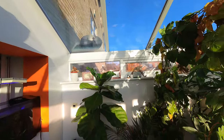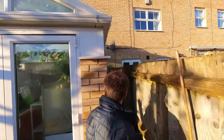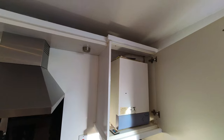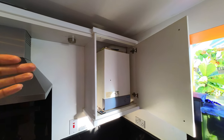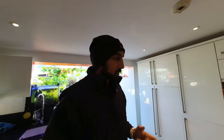We're going to have to plume that up. It looks like the boiler was here and then they put in the conservatory afterwards, otherwise that flue wouldn't have been allowed. The only thing we need to consider is the depth of the old boiler versus the new boiler, because it's a side flue, not a rear exit flue. The new one is slightly shallower, so we might have to break open the flue hole a bit. The drop test is done, let's get this one off and get started.